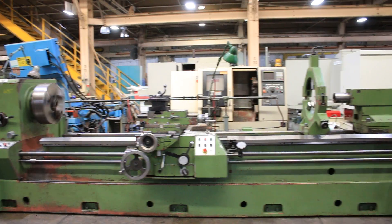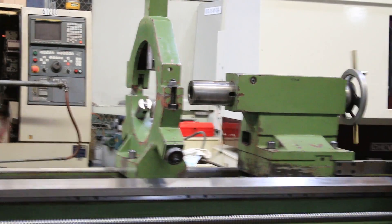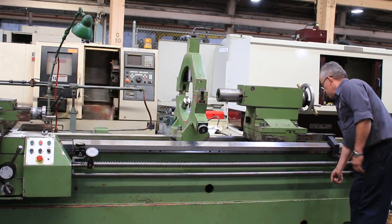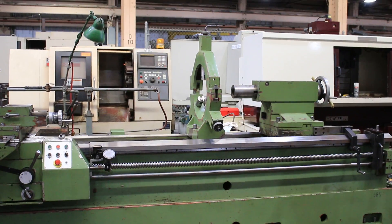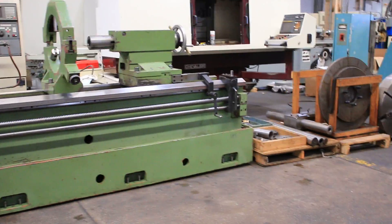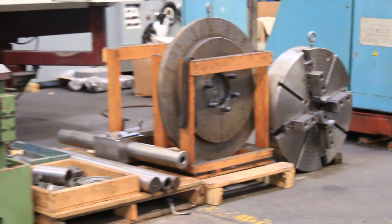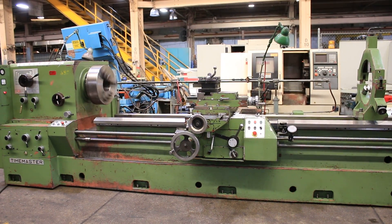So you've seen the rapid, you've seen the feed, you've seen a thread, and you saw a bunch of different spindle speeds. That's the tailstock — the tailstock is a number six Morse taper with nine and five-sixteenths travel. That's the adjustment for the tailstock alignment. It works off the rack with the handle. He's got the large steady rest. You have a taper turning attachment over there in the other corner. We have a four-jaw chuck, a large faceplate, and a boring bar attachment. Again, the machine has a four-way tool post. Thank you for watching our video.